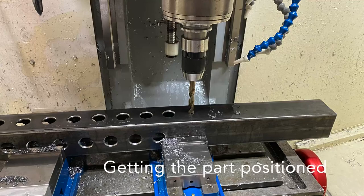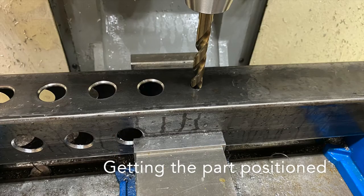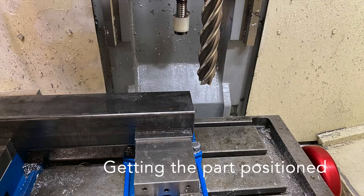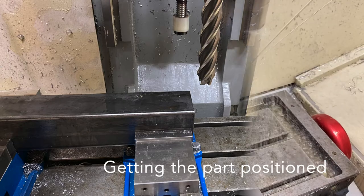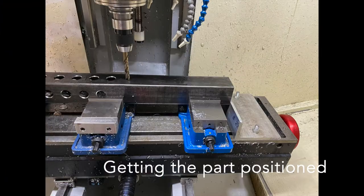Here I'm drilling a 13mm hole intended as a reference point to move the tubing. All good, except when I checked the length it was 1/16th too long. Recognizing my brain fart, I trimmed the piece to the right length and positioned the stop correctly with a 1-2-3 block.